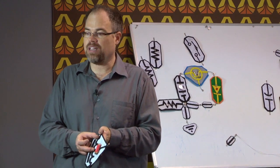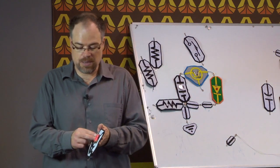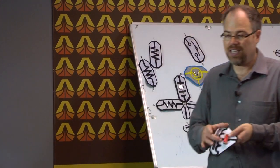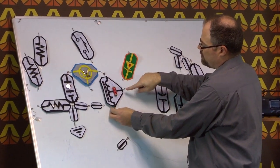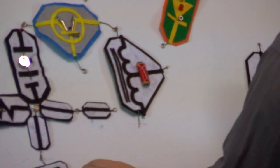But it's important to realize that this part behaves on its own, and this part behaves on its own. One is up here, one is down here. The loop stick connects the two of them together. The loop stick changes the efficiency with which the magnetic field travels from one side to the other. And we can see that if we pull it out, it will change the relationship on the board. So this is important. Instead of lighting up an LED, we are going to create magnetism. So we take out the LED part of our circuit, and we put this in place. And we're going to go from here to here. So we're going to engage this little wire here to get us there.